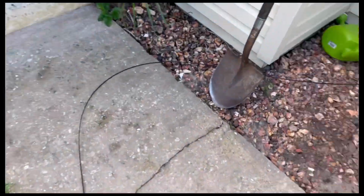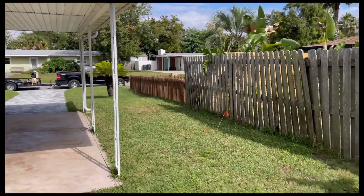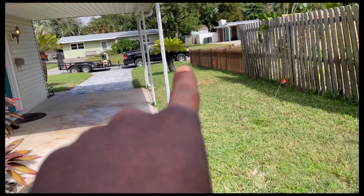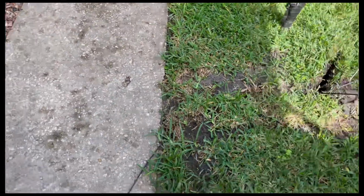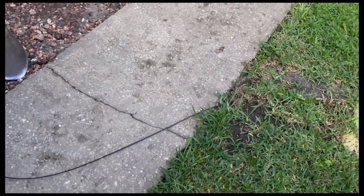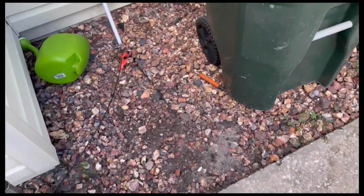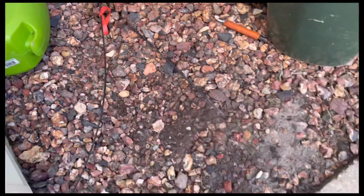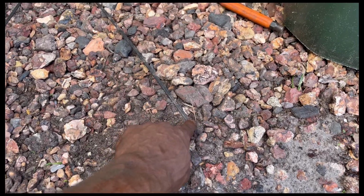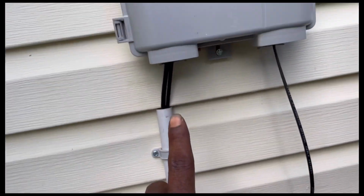All right, fam. We had a new job site already done buried up from the front of my tire on my truck. You see where the last flag at? That's where the terminal's at, and it's the actual terminal. When you're placing in a new line going up under the slab, we're going up under this sidewalk. Now, to avoid having to use the machine or use your hand drill, in most cases, which in this case, it has the temporary line that the tech just installed, which still had the ribbons on it. Then you have the old line. So now the old line is still intact going up into the NID.